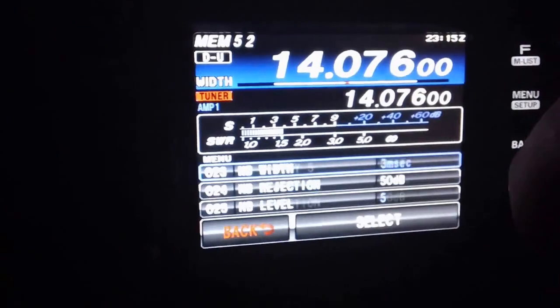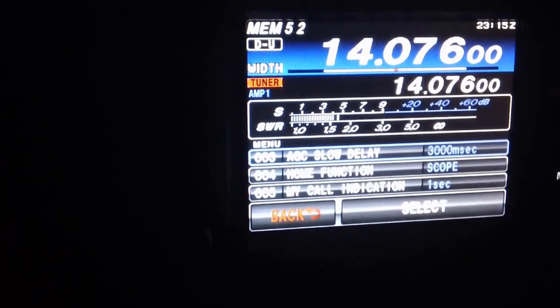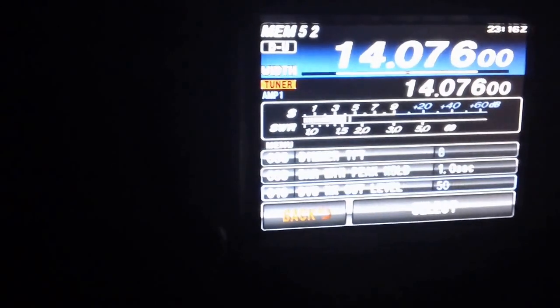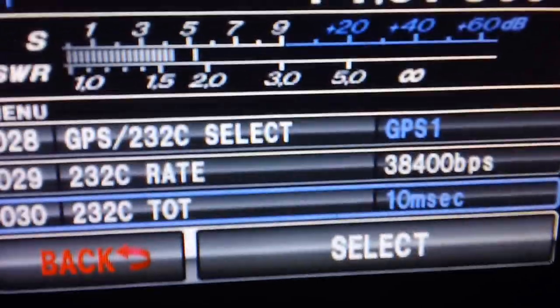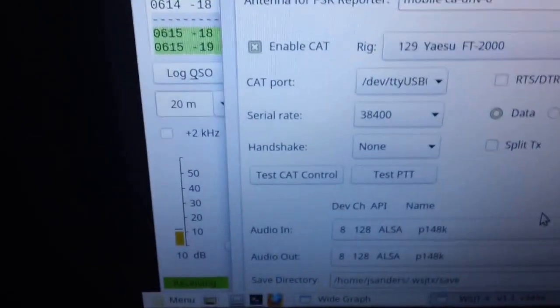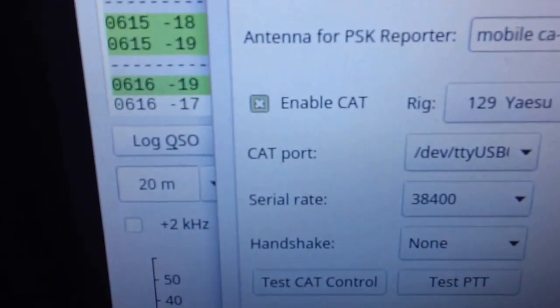Moving through the menu to find it — that's the baud rate. It's the RS-232C rate. Mine is set to 38.4, and that has to match. In WSJT-X, you want USB0 — or COM1, whatever it is on Windows. Mine is /dev/ttyUSB0. I'm using rig number 129, Yaesu FT-2000, for my rig configuration. PTT method set to CAT.